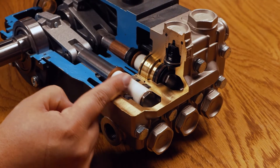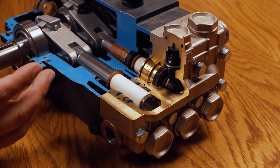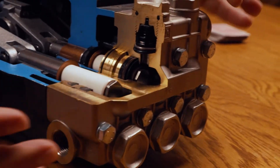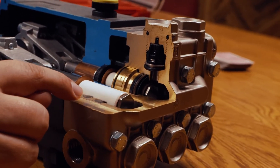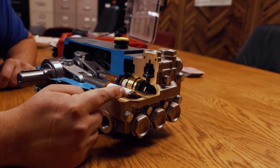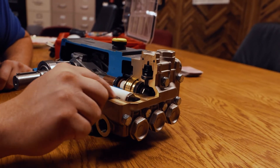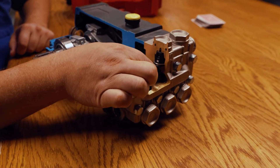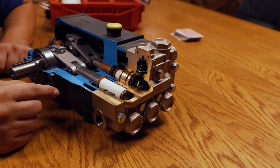Then we've got the ceramic plunger — it's a special grade ceramic with a nice smooth surface that handles loads very well. Then we've got what's often called seals, or a packing stack — there are a lot of different names — but that refers to this right here, specifically designed for a pump so that when the pump head is on tight it's loaded, meaning it's kind of squeezed down and everything hugs the way it's supposed to to seal. You've got low pressure seals and high pressure seals. When you've got 4,000 psi on one side of that seal, you don't want the water shooting backwards — you want it to go where it's pumped. There are retainer rings and head rings for a lot of these things, but basically that's what's keeping your water where you want it. The plunger is moving the water by pulling it in and pushing it out, and the check valve is keeping it going the direction you want.